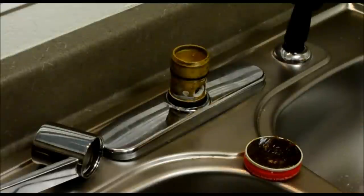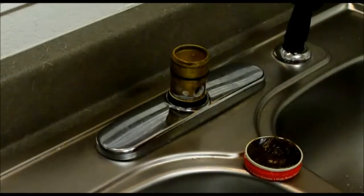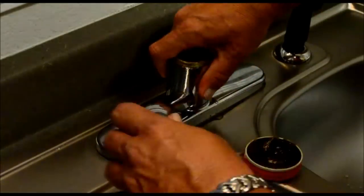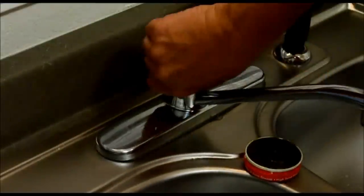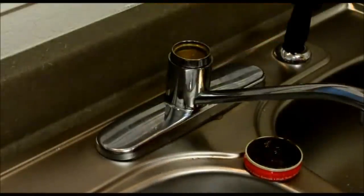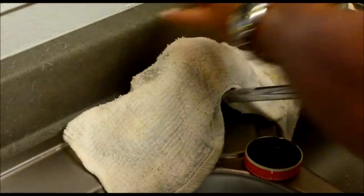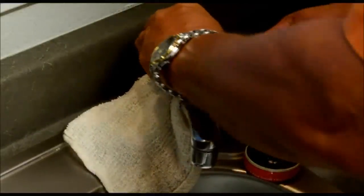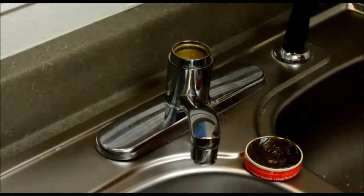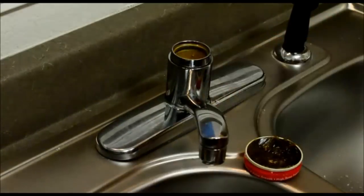You don't have to grease the inside of your spout. The o-ring's got enough lubricant that it's going to need. Now we're going to go ahead and put the spout back on. And as you can see, that's turning really nice. We're going to put our new nut back in place. Get the rag. This nut doesn't have to be too tight, just snug it up. Check your faucet, your spout — you've got good mobility, good turning. Easy. You're good to go.